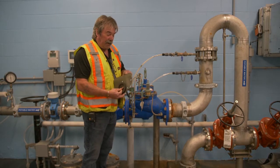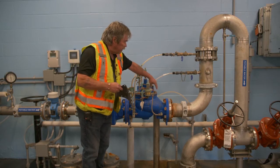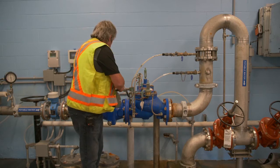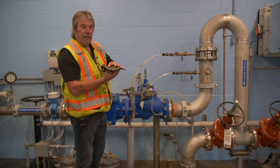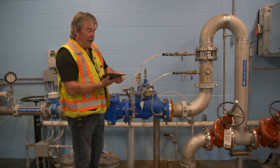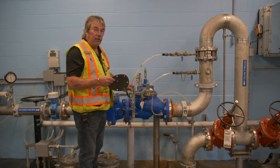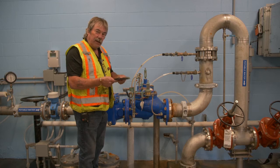This isn't the correct diaphragm for it, but just to show you — in here underneath this bonnet is a diaphragm like this, and this goes up and down as the water pressure is increased or decreased. This diaphragm is actually for controlling flow, so this is a pressure reducing valve, and it'll keep flexing like this all the time.